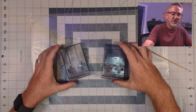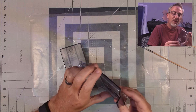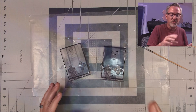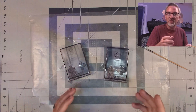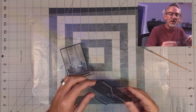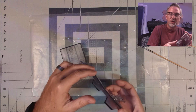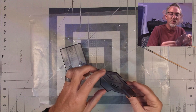As far as the time it takes to process - if I can't dip it quickly and get a result I'm super happy with, it's probably not worth it. However, if you're looking to make your resin prints look more transparent, this is definitely something you can try and it definitely helps. If you have any suggestions or have played with transparent resins and have other ideas of how to make things look very transparent once printed, drop those in the comments. I may do some passes of wet sanding on top of this to try to polish it even more, and if that turns out nicely I'll post another video or share on Twitter.